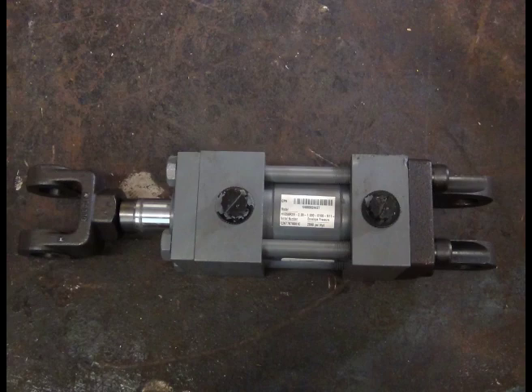This is a hydraulic cylinder used in the lock and unlock system on all the drives. The smaller drives take a 2-inch bore by 2-inch stroke, and the larger drives take a 2-inch bore by 3-inch stroke.